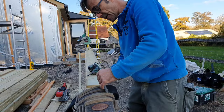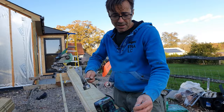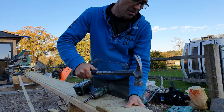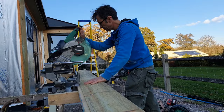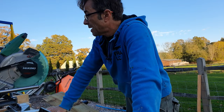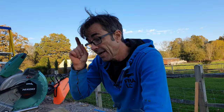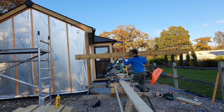I tack the stop in at the end here, and that's it — I've got repeat cuts now. I complete the cut and get an off cut which is a bit short, but usable in a few places. I'll set this out, mark my rod properly, work out how many courses I've got all the way around the building, and see how many full lengths I can run without a series of joints. Let's take this one in and try it between the posts — that's absolutely mint, perfect.